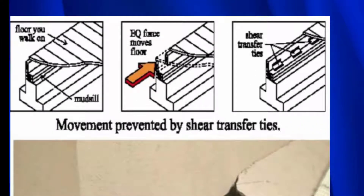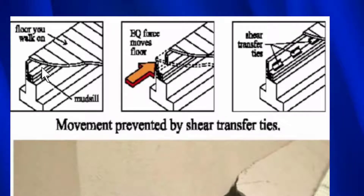So this is what we do. Here's the end joist, there's the mud sill. We want to make sure they stay together because, as shown by this arrow, earthquake forces come this way. They push on the end joist, but it's just sitting there on the mud sill with just a couple of nails, so it's going to slide off. So what we do is install something called shear transfer ties — those are pieces of metal — and that way when the earthquake force comes this way, that metal has attached the end joist to the mud sill, and we end up keeping the floor from sliding off the foundation.